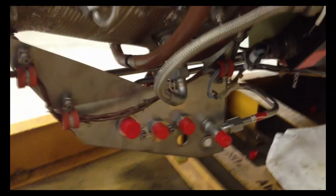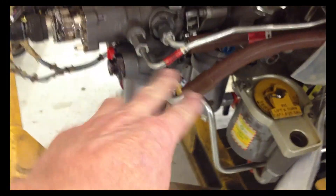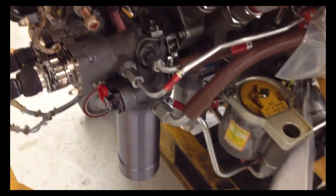Essentially that's going to be a fuel control change, because we don't change these solenoids independently on the line. You would break this Marmon clamp here and pull these fuel lines and pull the whole fuel control off.